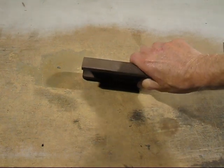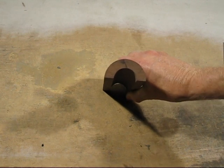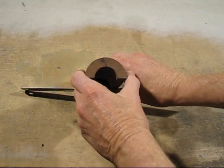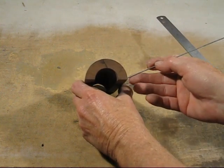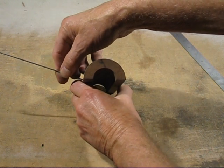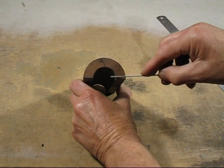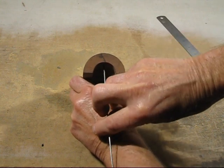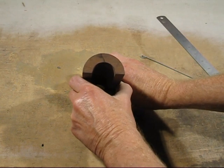Now, the second set of drawings in the magazine shows shapes that become less free venting. When the steam escapes, it still has a path out and nothing is stopping it — but the problem is when steam comes out from adjacent areas and they interfere with each other. The same happens all the way around: steam coming from other parts of that green sand core interferes, so it becomes less free venting.